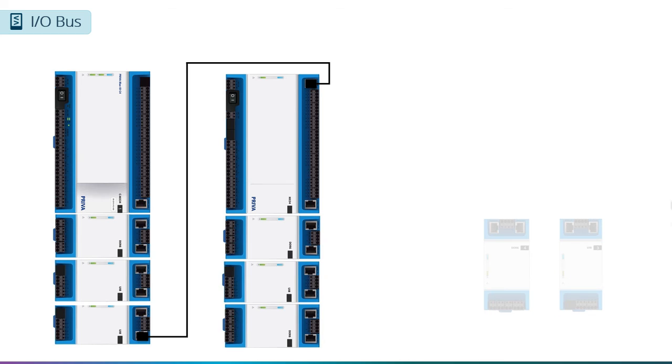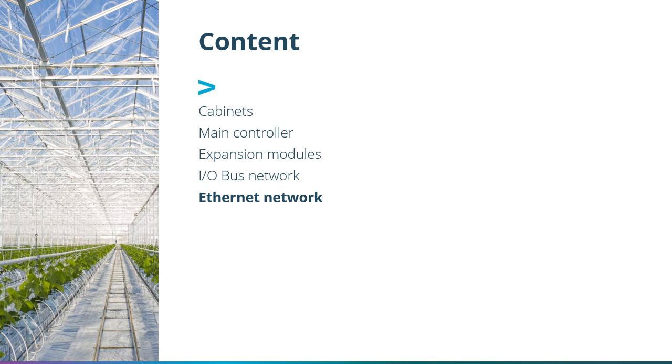If you have a Compass 4S, it comes with both the CMX34 and the MX34 pre-installed. The I/O bus cable is also already pre-installed. You can add up to 6 different small I/O modules. Move the I/O bus cable from the CMX34 to the bottom module in the first row and add the I/O bus jumpers that came with the modules. Your compass also came with labels for the modules. Stick them on the modules and place them in the same order that you have the I/O bus cable connected.